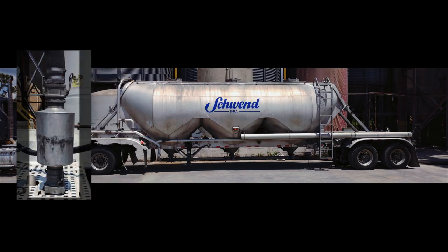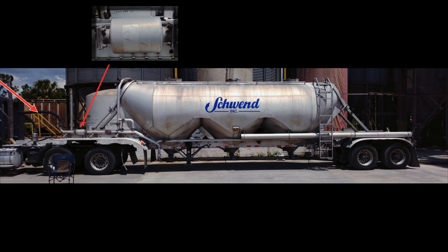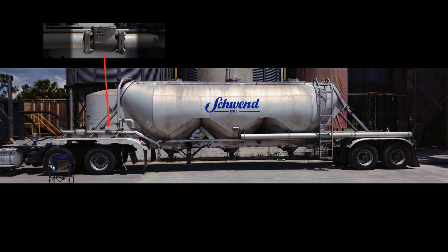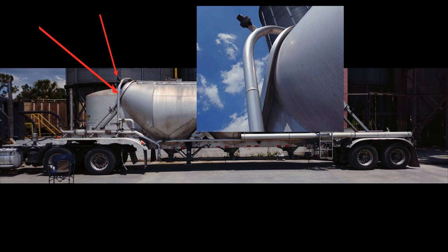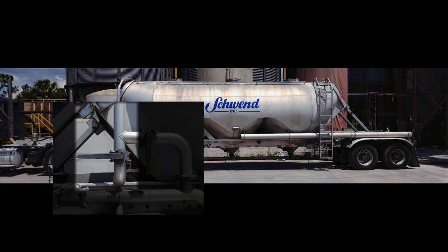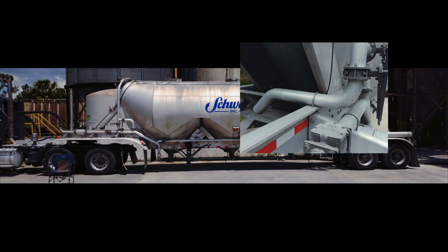Now you have a muffler that hooks up to your air output fitting. Next there is a 3-inch hot hose. A second muffler. Second check valve for back pressure and product precaution. Up here the pressure relief pipe. And second pop-off valve. Pressure relief valve, or blow-off valve, for the tank. Here is where the pressure will exhaust.